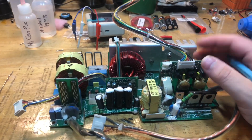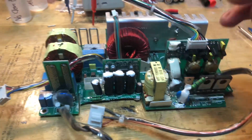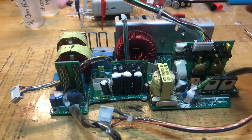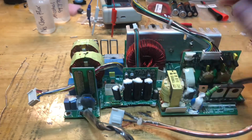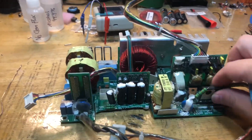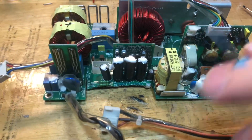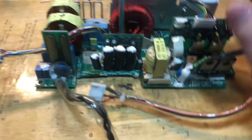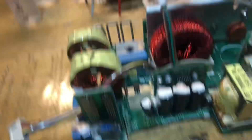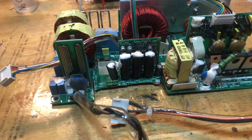So the reason why this is here is because I have to extract these three capacitors right here. These are 2200 microfarad, 10 volt electrolytic caps. The customer wants me to just replace the three caps in his power supply with good ones, so we're putting these ones into his power supply. As replacements, they are rated for 105 degrees and they are 2200 microfarad at rated 10 volts.